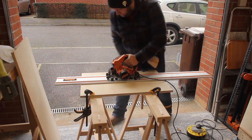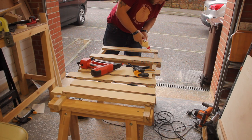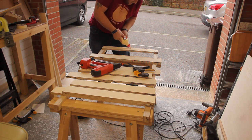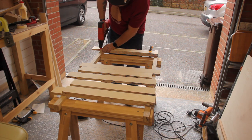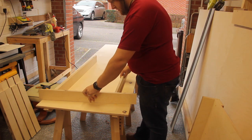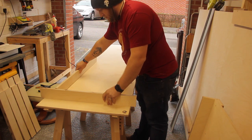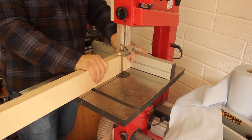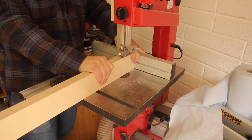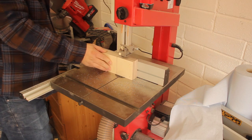We're taking it apart and starting 90% from scratch. The plan now is to make two sets of legs — two legs on either side — that will come together to create a sturdy base. There's going to be six legs with four sections to each. Same as before, I'm doubling them up to make them a little bit stronger, and then using half-lap joints, which is what I wanted to do in the first place. I'm cutting these out on the bandsaw because I forgot to do it the easy way and had to cut them out in the end.